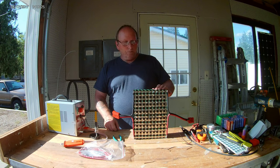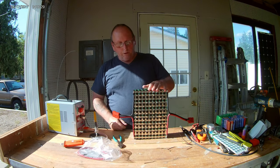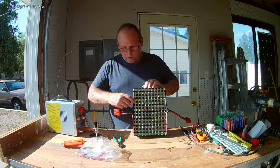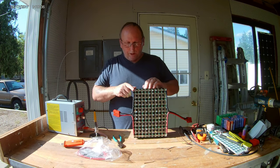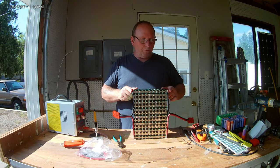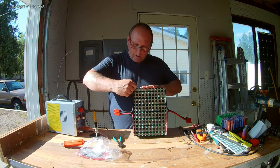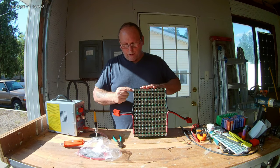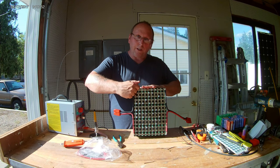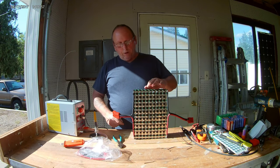So I'll get this installed next video. These 8 gauge here, what I did is I extended the tabbing wire out just a little bit further, and I rolled it around there. I soldered up the ends, and I run a line of solder on the inside, and then I soldered up this edge right here, so on all 4 of them, so they're all soldered pretty good.